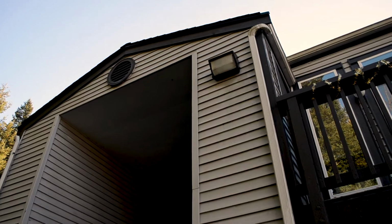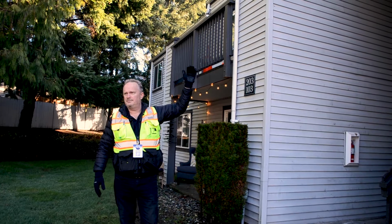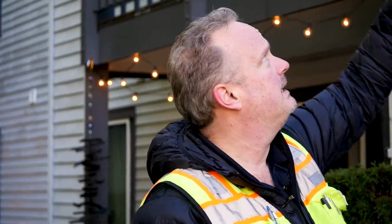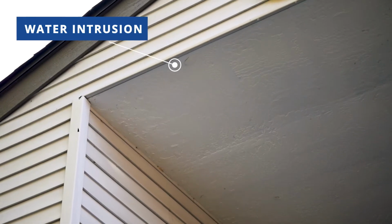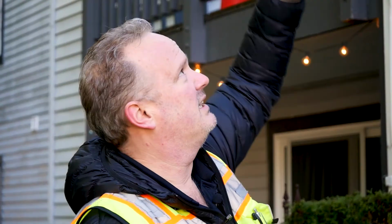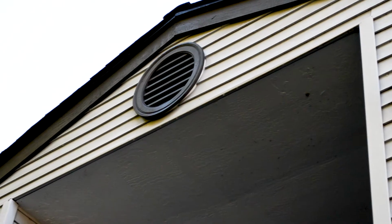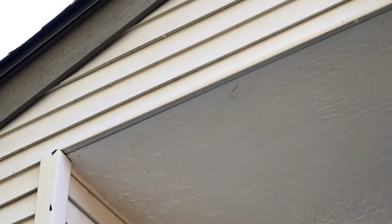We're looking at entryway soffits. I want to look for any obvious water staining, but in this soffit I'm seeing the texture delaminate or peel off. We can see on the 3 feet from the left-hand side here, you can see this bubble or tear, and it's right out at the edge. So water's coming down that siding and rolling around and getting in there and causing this material to delaminate. It hasn't stained yet. Maybe it's been recently painted, but we're already delaminating. That's a fairly common thing. You can just look up and say, yep, I got some problems here we need to address.